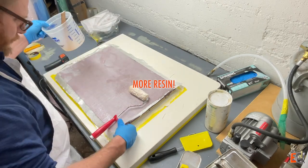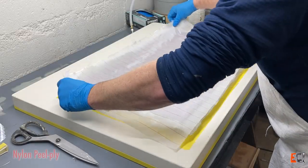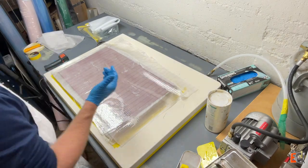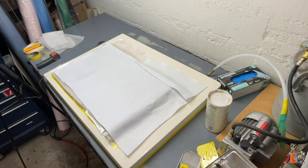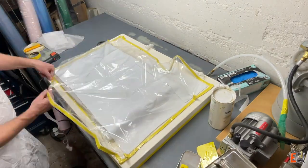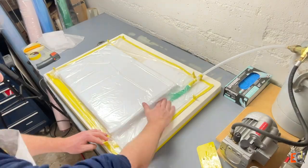Overall, the thickness consistency and the dents that were already in this piece of XPS foam made it so that it was not super uniform. Here's a nylon peel ply and a perf film that has small holes relatively far apart, and some super heavy breather because it's what I had — thinner would be totally fine. I'm bagging this up and I'm only going to pull about half vacuum. The idea is that if I pull full vacuum, it'll bleed off unnecessary amounts of resin and could also crush the foam. I'm hoping the vacuum will push down on that resin-rich veil and squeeze some of that resin up and out into the foam.